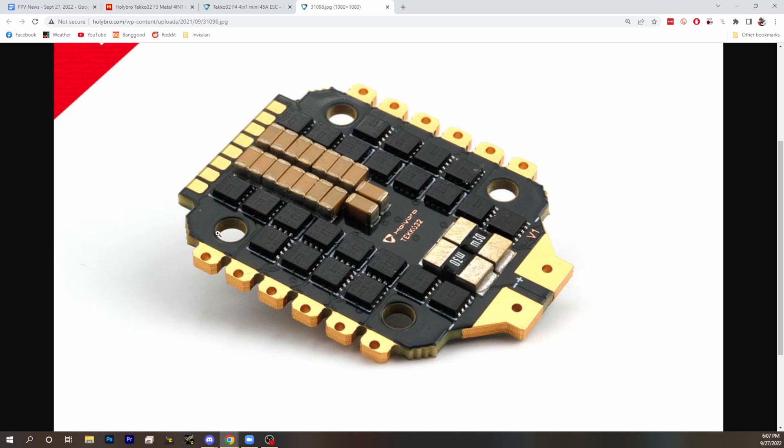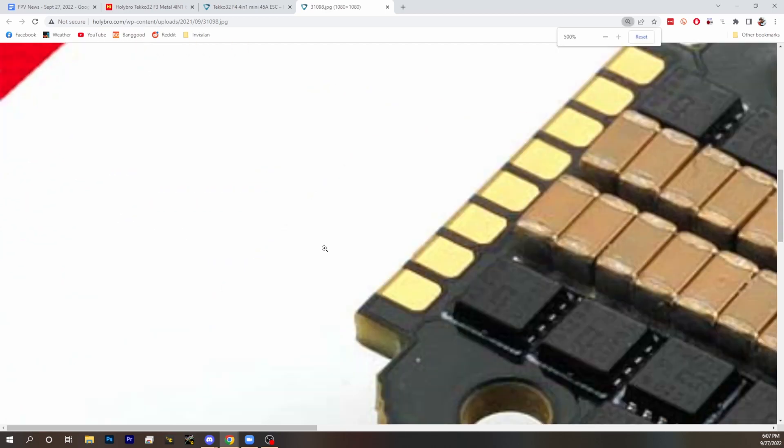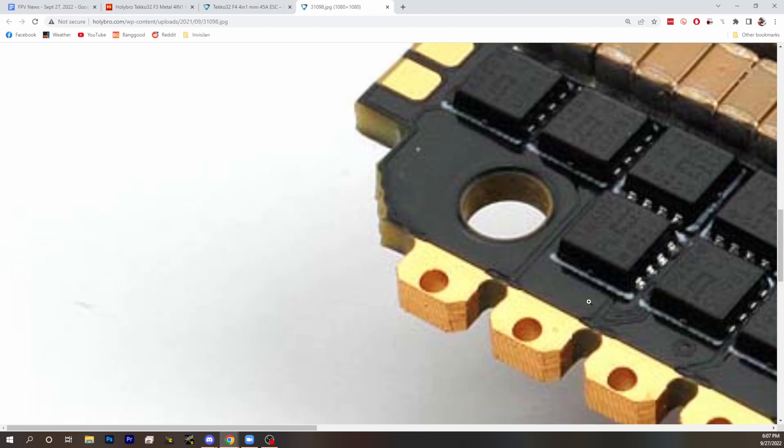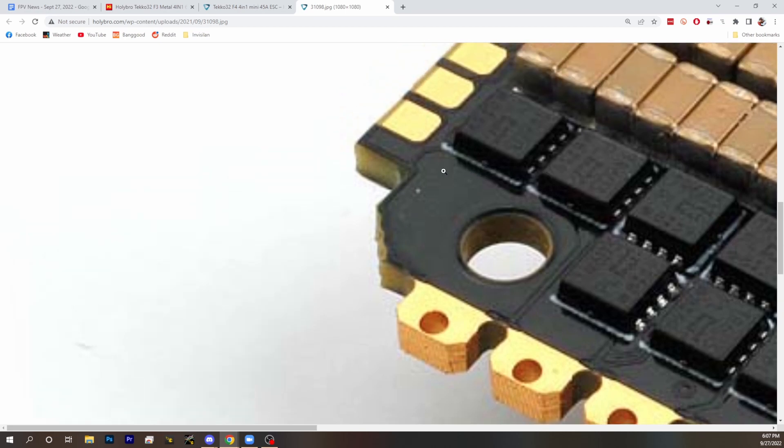Whether it's their manufacturer or their choice, this is definitely going to be a concern for anybody who does not use gummies in the ESC. You can almost see it here — you've got the FETs outputting current, and you can see this big honking thick trace. That's how they've laid it out and it's carrying all that current. Basically this is the trace that carries current to the motor output pad, and it goes right past the mounting hole where there's copper on the inside — and it's conductive. If you have metal standoffs, it basically runs the motor current into the frame and fries things.